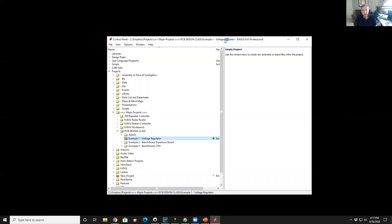So one of the questions I get asked a lot is, which tool should I use? So the answer is, for hobby use, the only answer is KiCad or Eagle. And the reason is because those tools have all the features that you need. They have all the libraries you're going to need. They have all of the fabrication house CAM file support. I mean, believe me, it's the low path to success, low probability of failure if you go down that path. I think if I were starting from scratch and I wanted the cheapest possible solution, I'd go with KiCad because it's free and it's not a commercial thing.